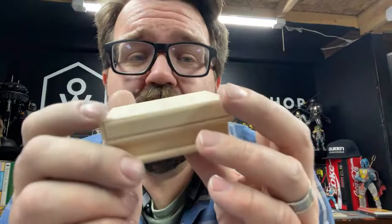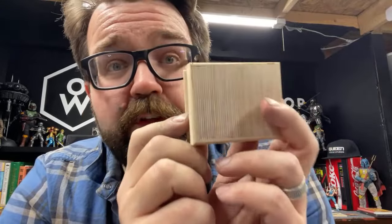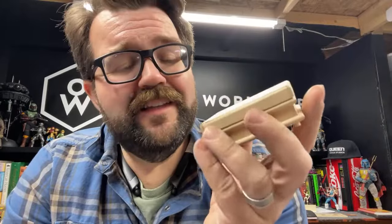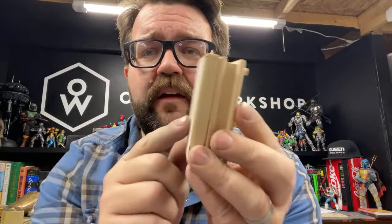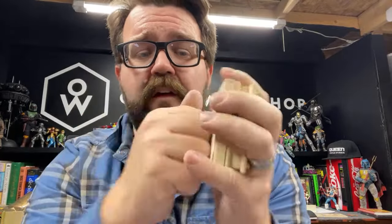And so I just finished this and I wanted to stain it. I'm gonna stain it, and sand it, and then seal it. So we'll do the first staining tonight. I'm gonna use this Minwax wood finish in ebony because I want it to look really dark, sort of burnt, without actually having to burn it, because you could do that. You could burn it, sand it, burn it, finish it. That looks nice too. But this is a light, soft wood. I wanted to stain it and sand it to give it an aged stain look. That's the words I'm looking for. And this thing is solid too. That top is actually that thick. That's not just the siding. I could probably stand on this if I wanted to, but I don't want to break it.